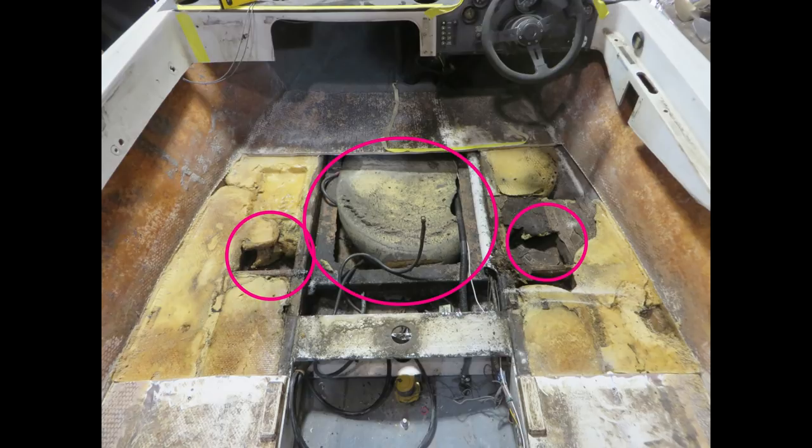For those wondering why not just fill this cavity with flotation foam from the bottom of the bilge all the way up to underneath the floor — the answer is easy. The original box maintained about a two to two-and-a-half-inch gap between the top of the box and the bottom of the floor. This gap is required for ventilation air to get from the front to the bilge area in the motor area. It also allows wiring to run above the box and below the floor, and the steering cable fits through that chaseway as well.